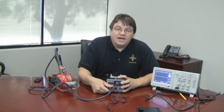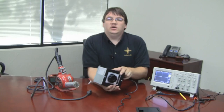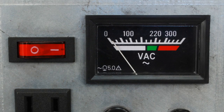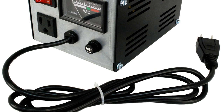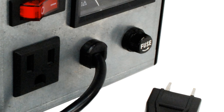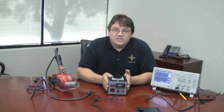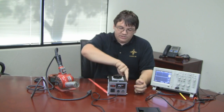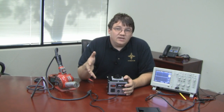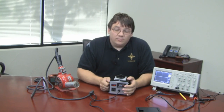When we went to design this product, we wanted to make something rugged and reliable. We've made a heavy sheet metal case, a great knob, and standard features include an on/off switch, a grounded three-prong plug, an AC voltmeter on the front, and a line cord — so you don't have to wire anything up yourself, it's all pre-done. There's also a fuse to protect the variac and anything you have plugged into it from overload. We've also added rubber isolator feet — this is a really solid platform, the feet grip well, and the design is rugged enough that if your bass player trips over it on stage and tips it over, it's not going to hurt it.